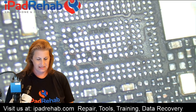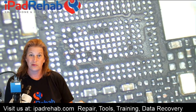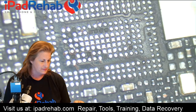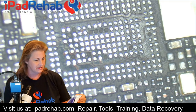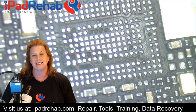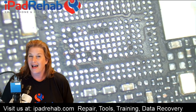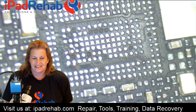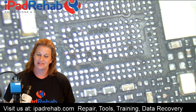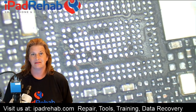Reading the note — and I love it when people send notes with prior repair attempts — this technician knew right away it had both a VCC main and a 1V8 line short. It's unusual to have a full short on two different lines. He spent some time trying to clear it, and he looked for a heat signature on VCC main but didn't find anything getting hot. So why would something not get hot? Things get hot when they have really high resistance — a tiny wire with a ton of current going through it generates heat.